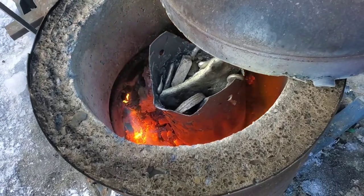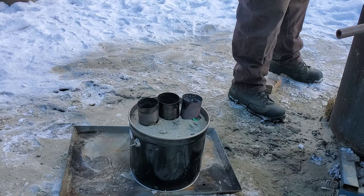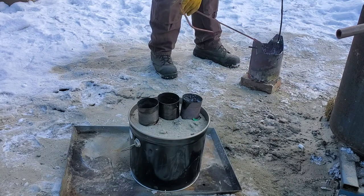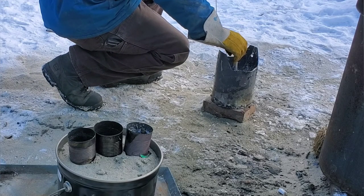The reason for this was the nozzle was all plugged up. In the last stretch of minus 30 degrees Celsius weather we had, I broke a line when moving something around on the foundry. I replaced it with a junky old line that I had sitting behind the shop and there was garbage in it and it plugged everything up.